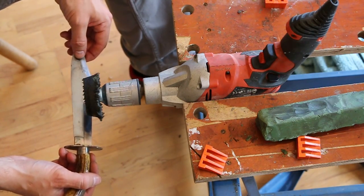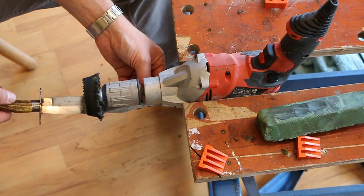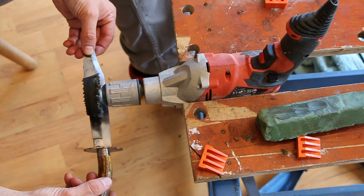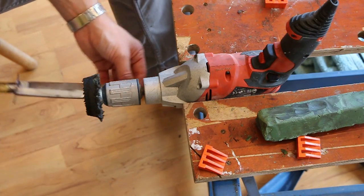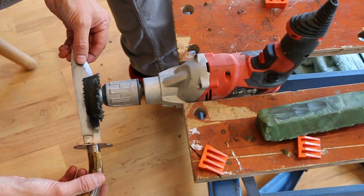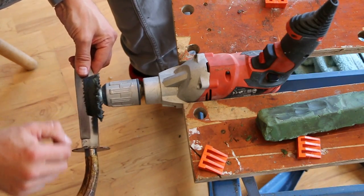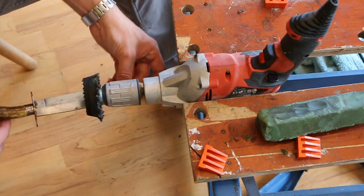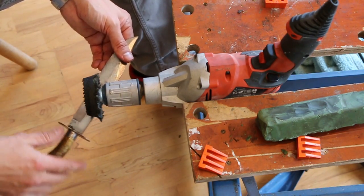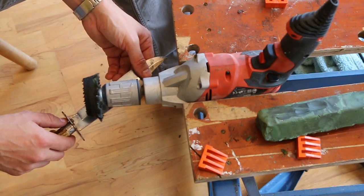So a little note there, you'll notice that I switched from being, let's say 0 degrees onto the drill to 90 degrees onto the drill, depending on what you judge as 90 and 0, but essentially changing it through 90 degrees. And that is for exactly the same reason as I said to rub in circles with the wire wool, because by changing the direction, you kind of overlay the micro scratches that you're putting into play, because ultimately with polishing, that's kind of what you're doing.